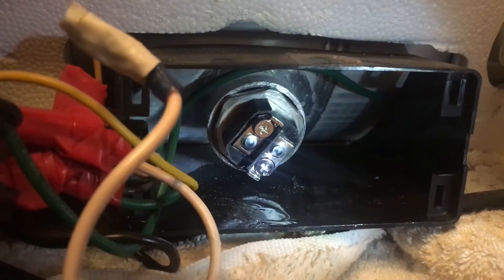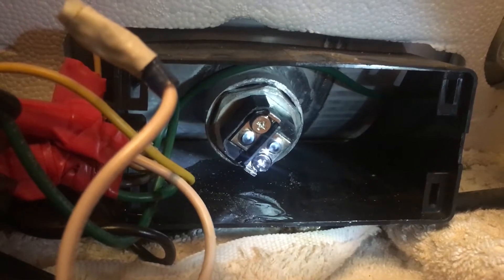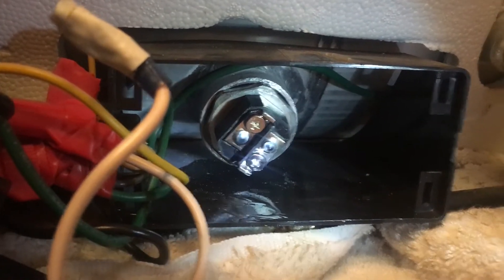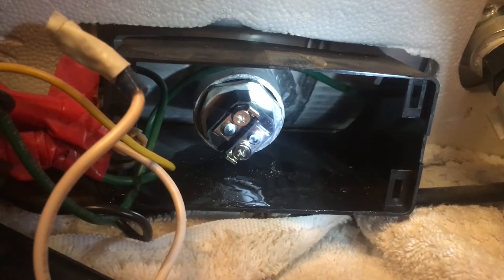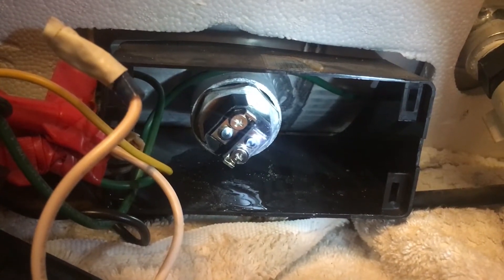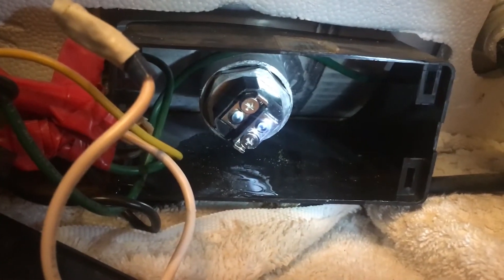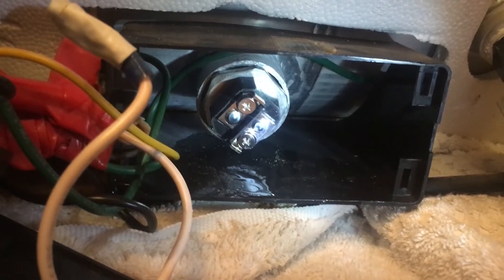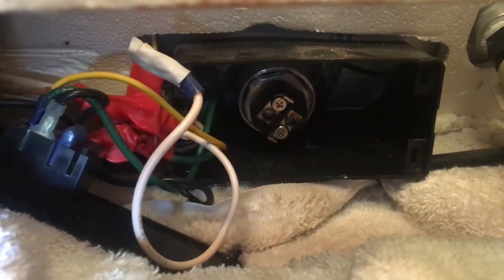It is very important that you do not rush and turn this thing on right away. If you turn on the breaker as well as the unit itself without water in it first, the new element you replaced will fry pretty quickly. Put the drain plug back in, turn the water back on, and let the tank fill back up. Make sure it is not leaking. I put the drain plug on outside — it was raining so I did not show that part — and I do not see any leaking, which is a good sign.